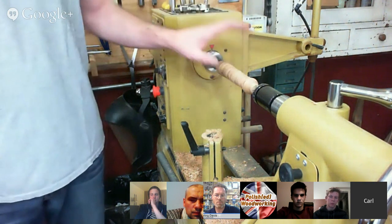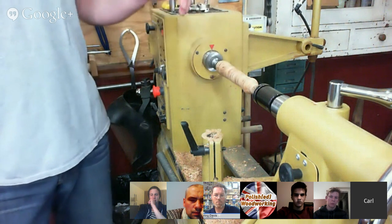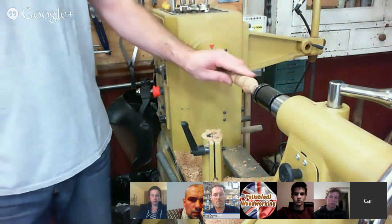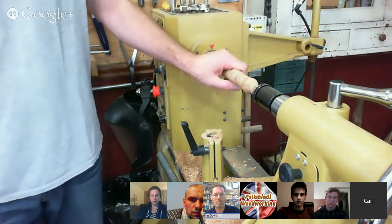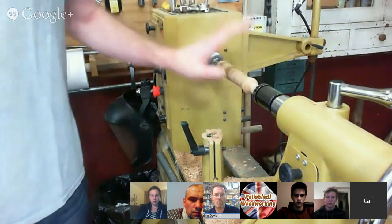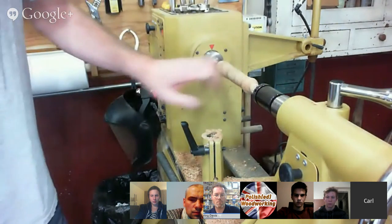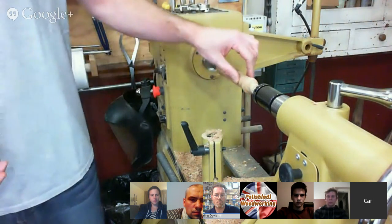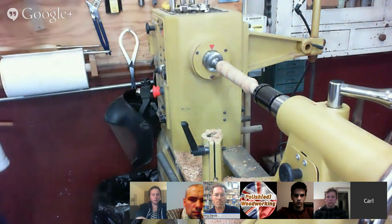And that's basically my number one reason why I use it. And I like a satin finish too. So, you know, it's a win-win for me. But if you want a shiny finish, just dry sand it and use something else, like a polyurethane or something. All right, so I'll just dry sand a little bit of it just to kind of show you.